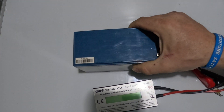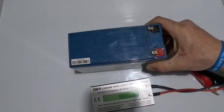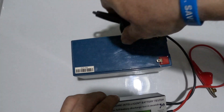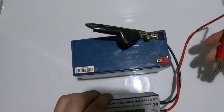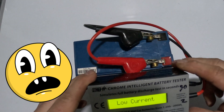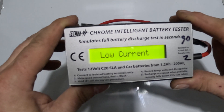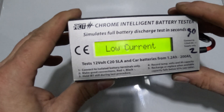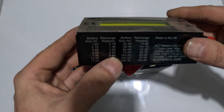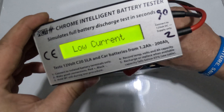In good Blue Peter style, I've got one here that I fitted some time ago and it failed. Let's test this one as well. That's my alarm system beeping away. Low current — I knew this was going to fail anyway. That's what you get if it's really failed. If it was a 7-amp battery reading, say, 3.87, that would have failed too, but this one is totally low current.